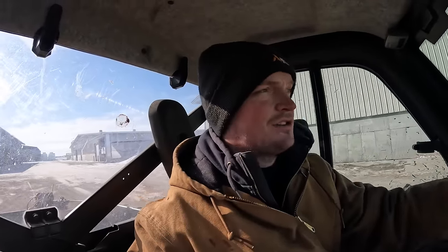Jason just got here, and I actually grabbed our excavator out of the shop. He's using our excavator. Started digging. We found the direction the water was coming from. We've got the water shut off, and actually at some point somewhere there's two runs tied into each other, because we had to shut two valves to get the water to stop flowing. So now we're going to pump the water out, which is, I'm going to grab the pump out of the shop, and then see if we can find exactly where that water leak is.